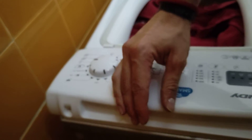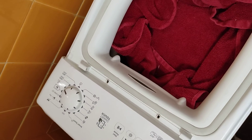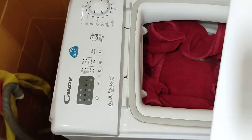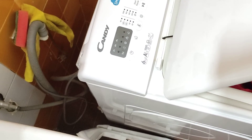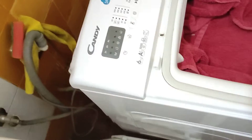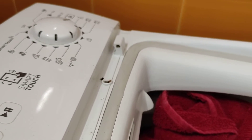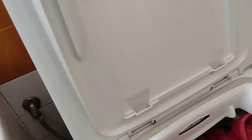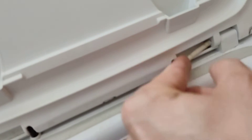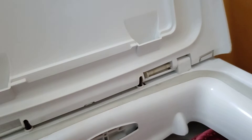This is then fitted with a screw at the back end, over here and here, and then we will put the lid on. When it comes to putting on and taking off the lid, there are simply two pins that will fit into these holes over here, and then it will go over these joints here. Now this is what broke on our previous top part, which is what spurred the replacement. So as that slots behind, we grab our pins — which we have carefully put where we remember — and they go through these holes and are simply pushed into place. Removing them simply requires a screwdriver to wedge in carefully and pull them out nice and gently.